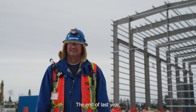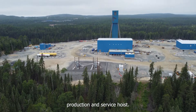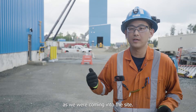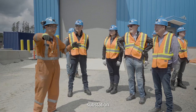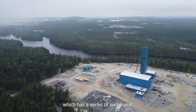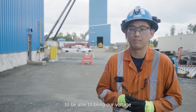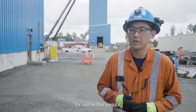At the end of last year, we brought permanent power into the shaft site to run our permanent production and service hoists, and that will also be used for our sinking. We have a 44 kV line that you've all seen coming into the site. That line runs to the shaft site, where we have a 44 kV substation that steps the power down to 13.8 kilovolts. We also have an e-house on site with a series of switchgear and electrical infrastructure, along with three medium voltage transformers on the shaft site footprint to bring our voltage down to the proper level needed for the various buildings and infrastructure.